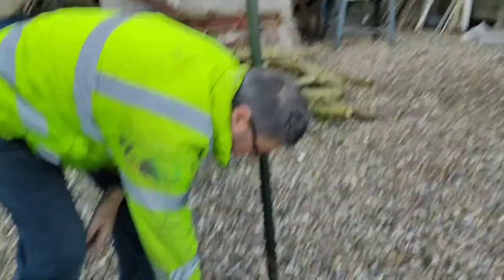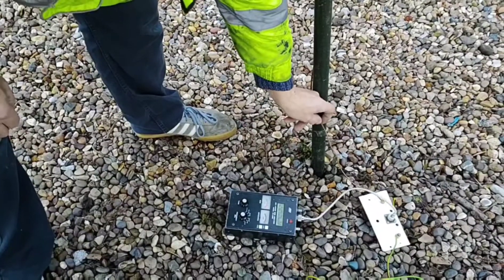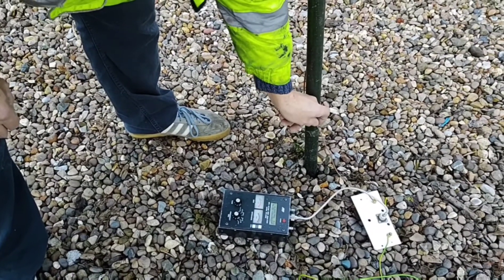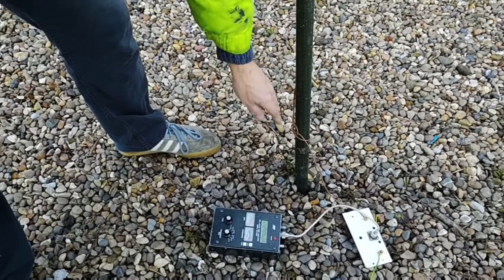Let's just say if it's resonant at 6.6 — that would be too long. So all you do, you just bare the wire back there and try it. Keep that bit dangling — see where it comes down before you cut it.